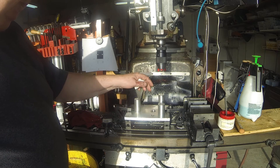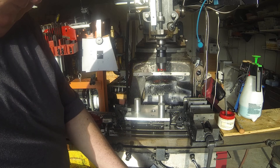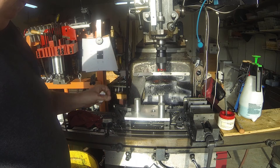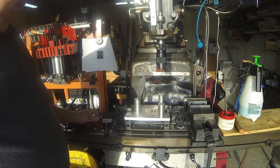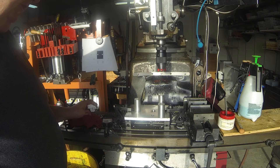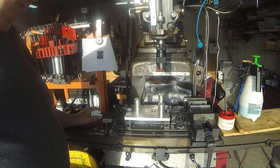This part here is going to be bored to two inches — that's so the drawbar can come up and through there. Actually, I think one inch may be enough. There are two holes here for the guide rods and those are bored a half inch. I've decided to use half inch tool steel for guide rods — I just happen to have about a three foot piece of it, so that's what we're going to use.